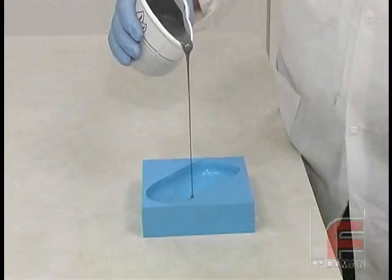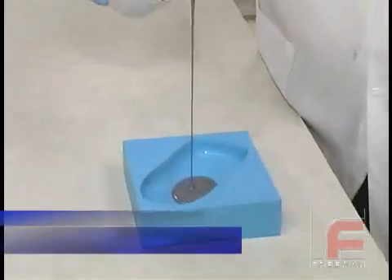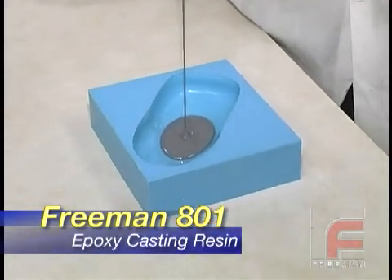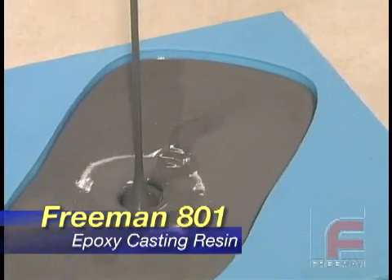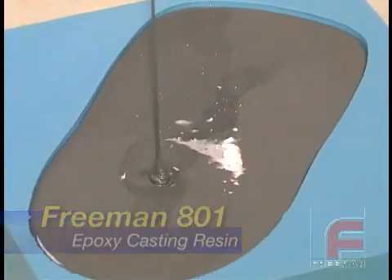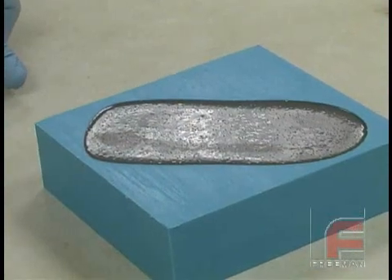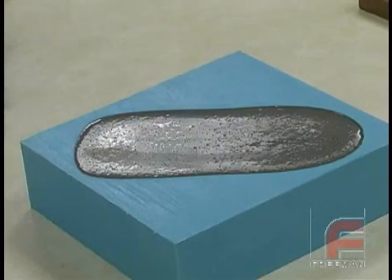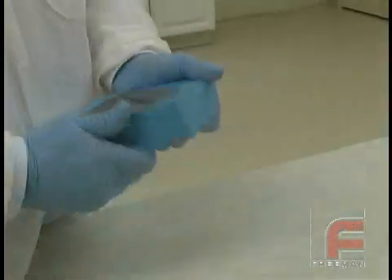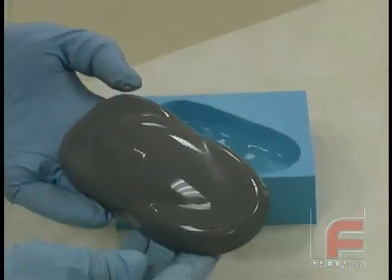This mold can also be used to cast other materials, such as an epoxy casting resin, as we're demonstrating here with our Freeman 801. Notice how the aluminum filler used in Freeman 801 will create a little separation of color that you only see at the bottom of the pour. After allowing the material to cure overnight, you are ready to demold. Notice how many of the bubbles stay on the bottom — the thicker viscosity makes it less likely for the bubbles to rise, break, and self-level. However, the surface finish is outstanding.